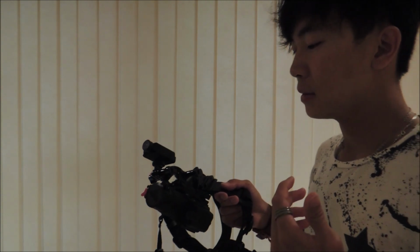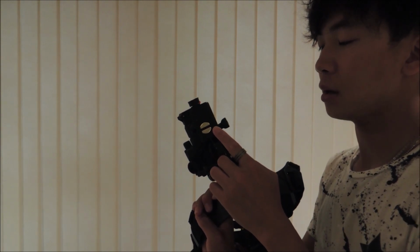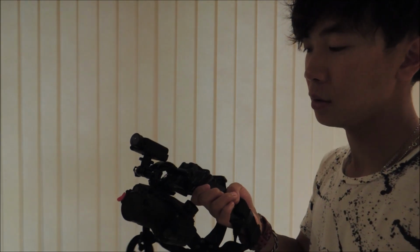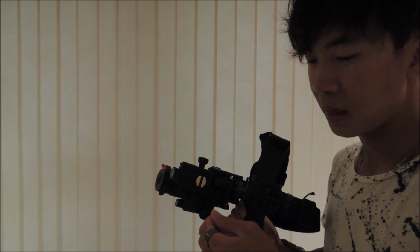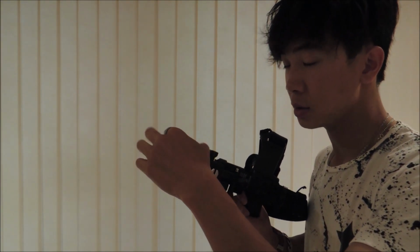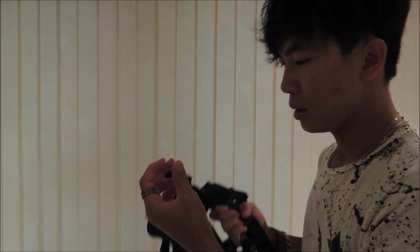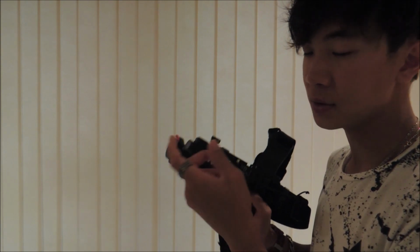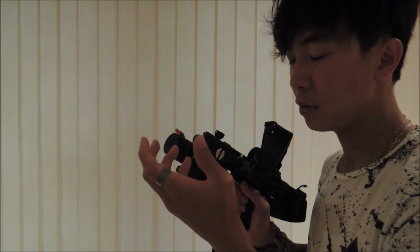So the way this is working is that all I did was just buy a Mobius camera with a wide angle lens, and I basically had to disassemble it. You take a Phillips screwdriver, and there's an Allen key that comes with the package. There's a little Allen screw, so then you can actually unscrew the lens out. Then once you pop the lens out, there will be a little square or circle. You see it as a purple or a reddish color.